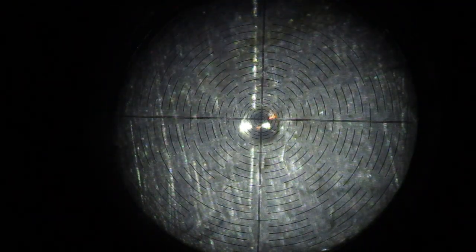The best way I found to center the centering scope is to make that little drill dot — or even a smaller one with the tiniest bit near center — and then put the scope in without moving anything, then center the scope on that dot. I'll move it up, move it back — I'm feathering the light a little bit with my hand, I think it helps — then bring it back to center. Now I'll turn the lights back on and show a little more on the usefulness of this thing.